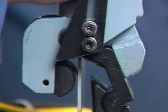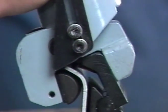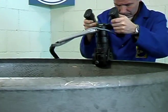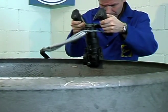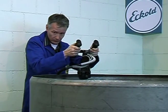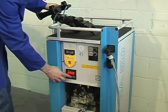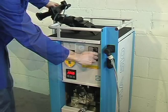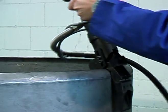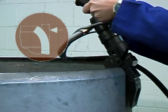And this is how the mobile tool works. The upper insert is pressing the metal gradually into shape against the lower insert. Pressure and working speed are now adjusted for the third and last pass. Flanging is finished with a short forward feed to ensure the best possible flange quality.